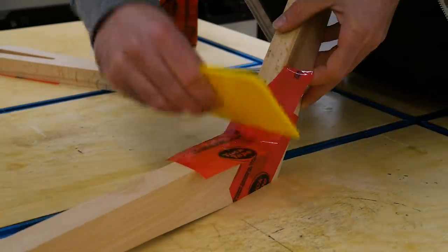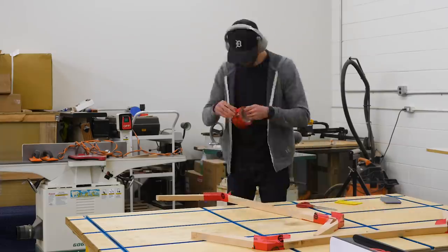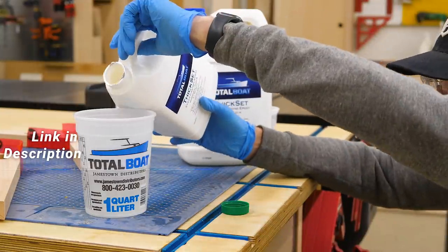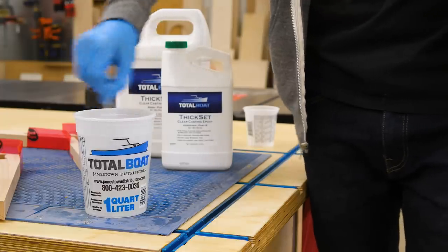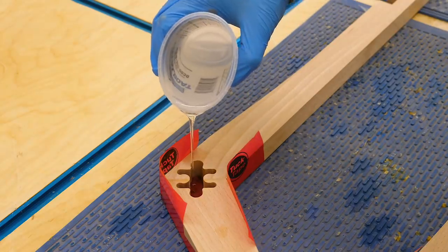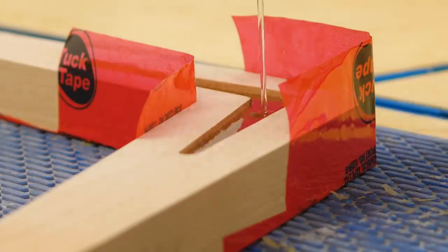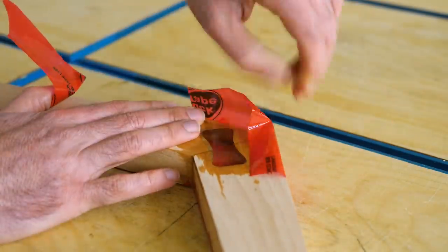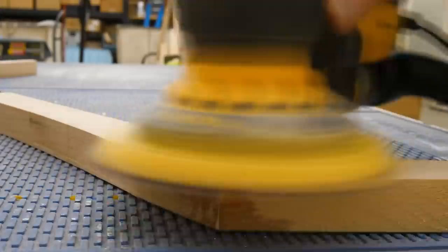The next step was to pour the epoxy. Before I did that, I made sure to spend some time doing a really thorough job of taping up everything, because I did not want it to leak. Once I felt like that was good, I used TotalBoat Thickset, which is their deep pour system — the same stuff I used on the crayon table and the splinter console. Whenever applicable, I'd say this is my favorite epoxy to use, because for whatever reason I don't get any air bubbles with it and it just seems to dry the clearest. With the shop being colder this time of year, I gave the epoxy a good 2-3 days of cure time before sanding. I let these sit over Christmas, then came back and sanded everything flat using some 80 grit and a little elbow grease.